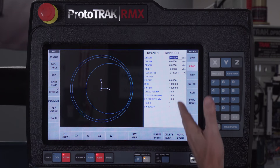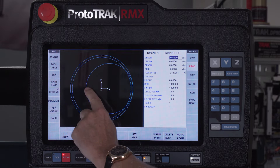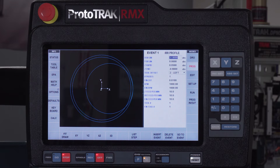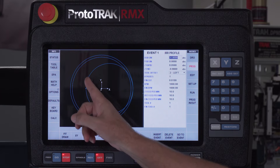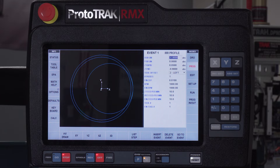So here's my irregular profile, and I'm telling it where I want to start. You can see right here by that dot that it's starting over here. My starting position is totally going to come from the fact that the arc I want to use to arc into the groove has to be larger than the size of the radius on my tool, because I'm actually offsetting, so my tool is really going to be in here. So I'm going to determine that and then just take from that section all the way into where I have the depth of my groove. My groove in this particular case is about a hundred thousandths deep. So I'm telling it here that I want to offset to the left because I'm going to climb mill this. I'm going to do it in one pass.